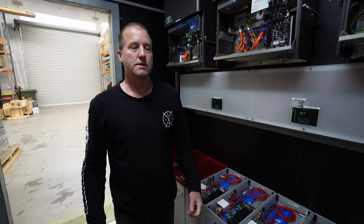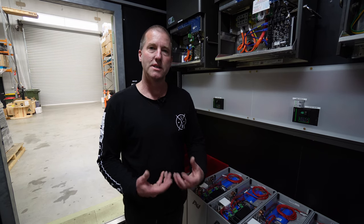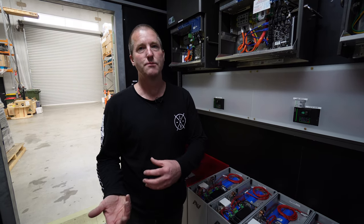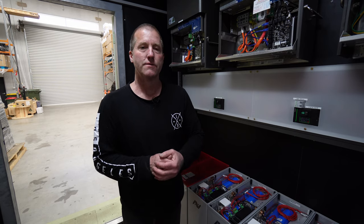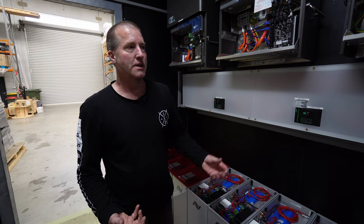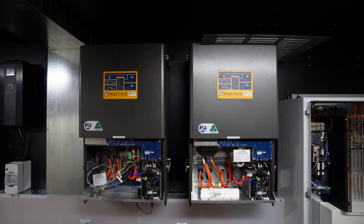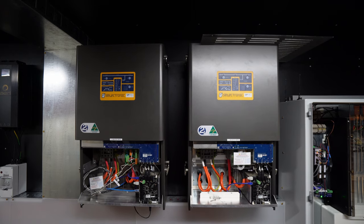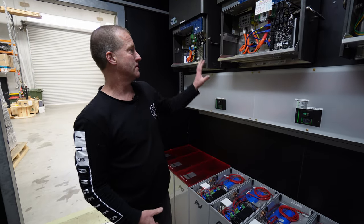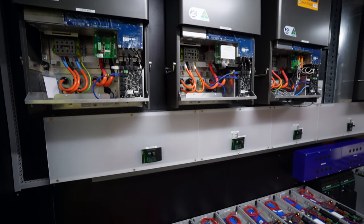And so we said, well, why don't we design a system to bring in the two-phase power and then convert it to DC, then produce a three-phase supply for you. And that'll give us the ability to add a lot more solar as well because we're off the grid. So we designed a system where we brought in two inverters off the SWER line, produce a DC bus, and then we reform three phase over here. And then we also have a backup generator for these three phases if we wanted to run completely off grid.